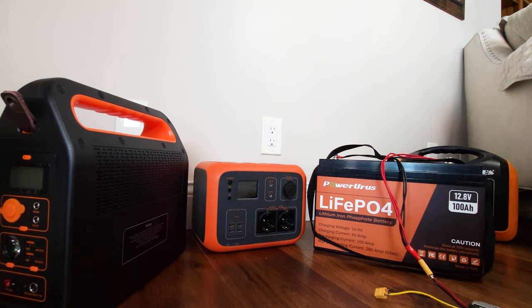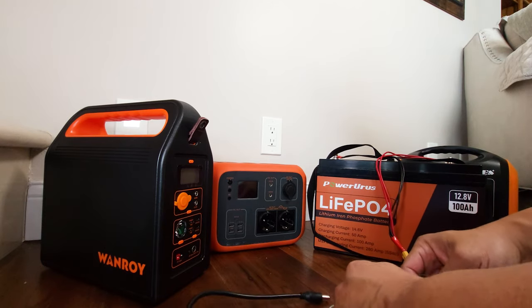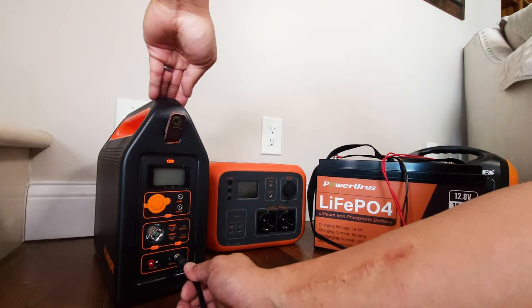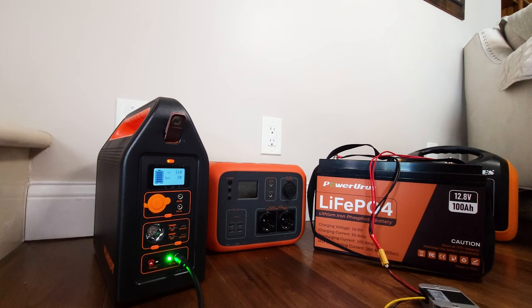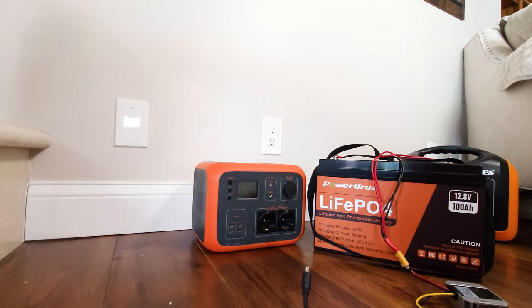With these five power stations, two of them take XT60 natively. For this Wanroy I'll just plug in my barrel connector. This one happens to take 26 volts, 4.75 amps max. Plug that in — as you can see, it turns on right away and starts charging. It's charging at 66 watts right now, partly because it's starting to get full. As the resistance increases, the speed of charge naturally slows down — that's the circuitry built into the battery. This one also has Anderson power pole options, which is another common connector type.